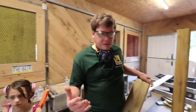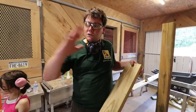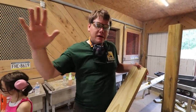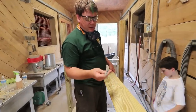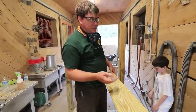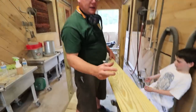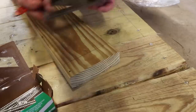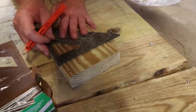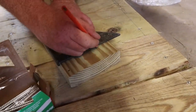Yep, so our 4 corner posts are up, our uprights. And now we have this piece here, a 2x6 that we're gonna use to span across the top and give that a lot of strength. We're gonna use these structural screws to attach them. I think we have a shorter version. This may be it in my hand, I'm not even sure yet, but I'm gonna go ahead and mark and pre-drill those, and that way we can hold them up, get them going in there, and we'll be good to go. This is going a little overkill as far as being really precise, but we just want it to look really nice quality when we're done with it.